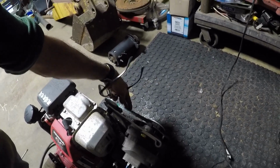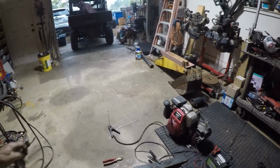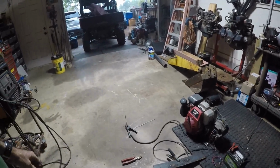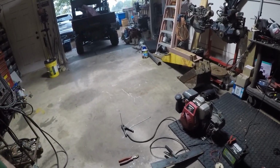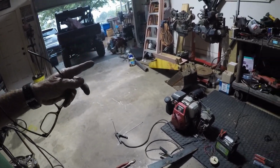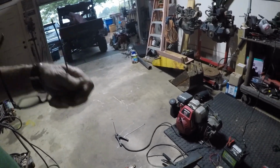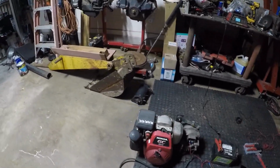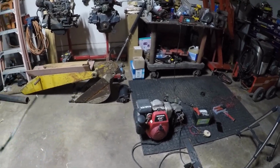That belt though is definitely holding better, because the way I had it set up on the old machine, it had a wide belt, like a 1/2 inch wide or bigger, like a deck belt on a riding mower. It is that same type of material. And I think that's where I messed up on that. You had to have it super tight. I actually made a little turnbuckle where you could have that thing so tight you could play a tune on it. Because if you didn't, when you hit the welder, it put a load on that alternator, it would actually slip.